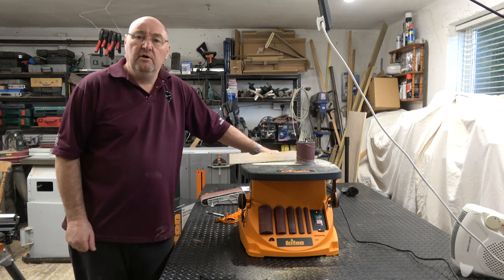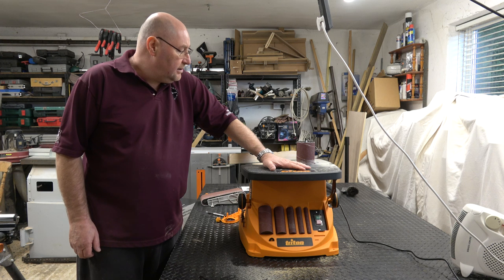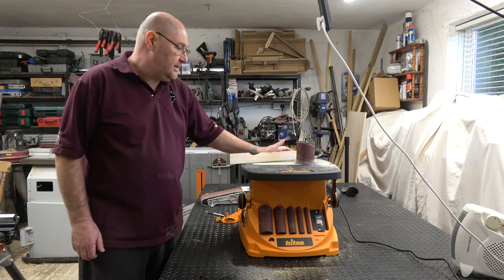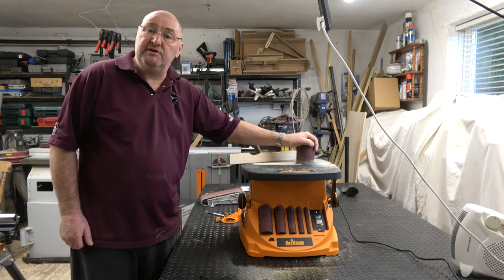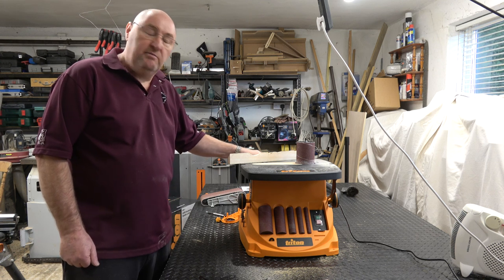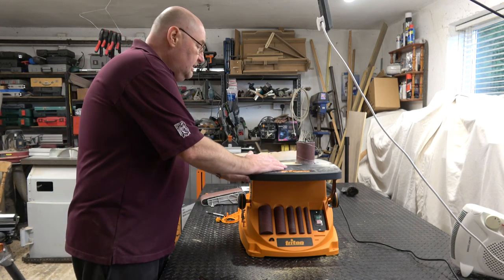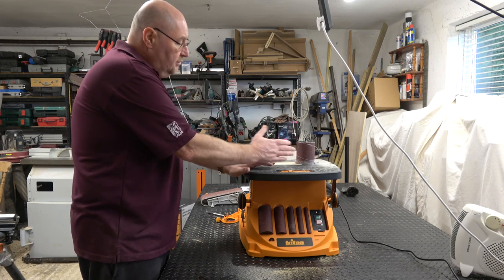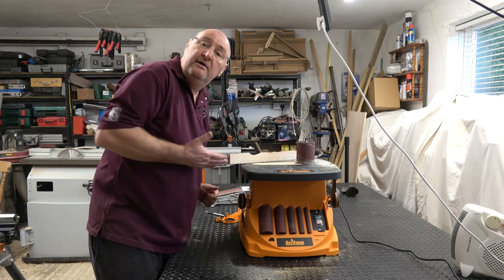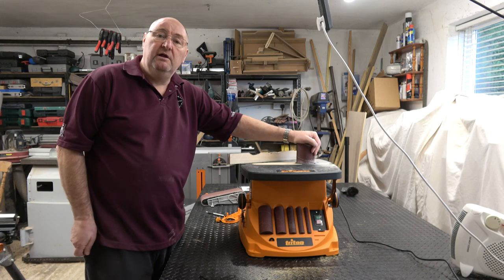The Triton 450 watt oscillating spindle and belt sander — I think this is a smashing machine. I love the fact that you can tilt the table for sanding at angles. If you're thinking about buying one of these, you should spend the extra money and go for the three inch drum and make an insert, because it's going to give you far more versatility and you're not going to be wasting money every time you buy another set of sleeves. Dust extraction is very important to me and it's phenomenal on this — I think it does a brilliant job. Is it worth the money? Yes, I think it is. It's going to make a lot of things a lot easier for me. I've got far more control, and it's a lot easier to have the belt vertical rather than horizontal — holding the wood against it while it's sanding is a lot easier. The drum sander part of it is something I've been wanting for many years. I hope you found this review useful, thank you for watching.